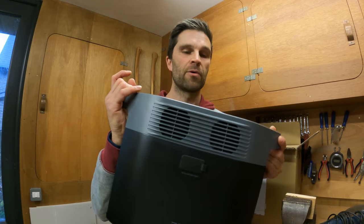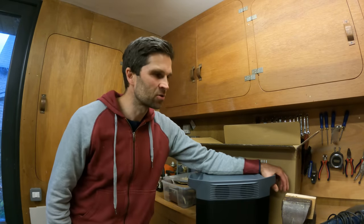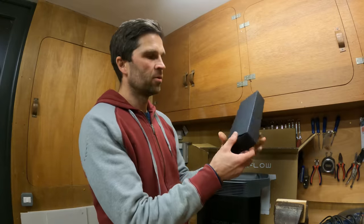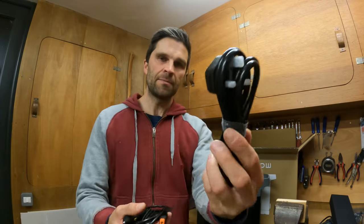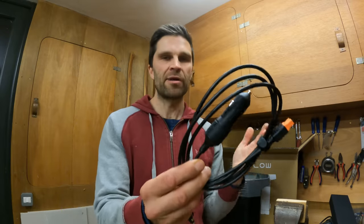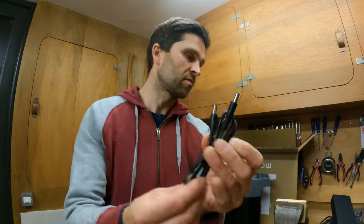For me today, I don't think there's going to be a problem because this has an 1800-watt output and my grinder is probably about 800 to 900 watts, so it should cope very well. The last things in the box are the cables — the mains charging cable and a 12-volt charging cable. If you're going to use this as a van life setup with this as your leisure battery and power hub, the 12-volt cable is essential so you can trickle-feed while your engine's running, and use solar panels when it's not. There's also another cable in there — all the specifications I'll put down in the description. For me, I just want to know if it works, so let's get on and make a knife.